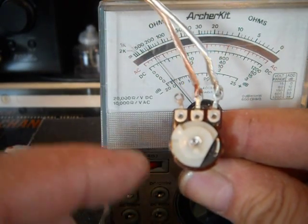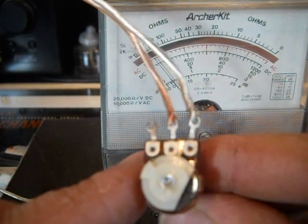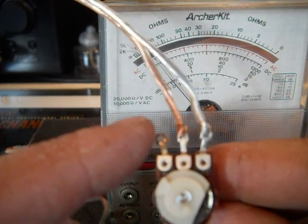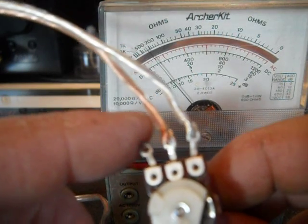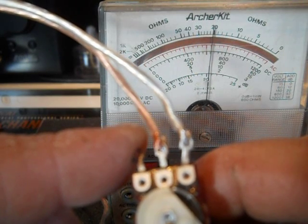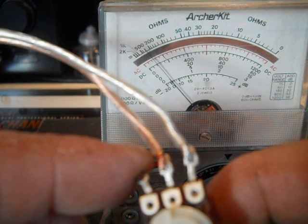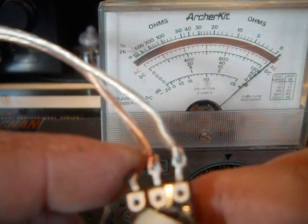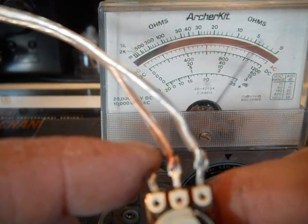It will help pull it down to ground more. I have put one of these in a microphone — I just don't have it anymore. I showed how to do it, where I had all three of these hooked up so it would pull it back to ground. It was a radio that was wide open for modulation, and the little knob on the stock mic kept the radio tuned down. You could turn the knob down and make the radio sound better. It was real convenient — a knob where the numbers were pinned on it, mounted through a couple holes. Same principle though.